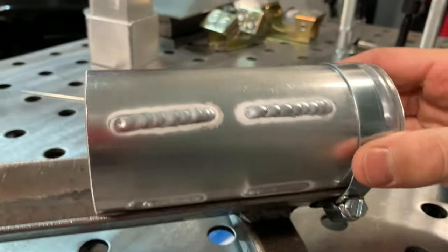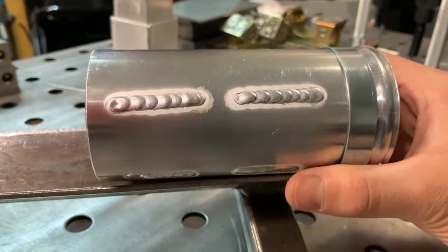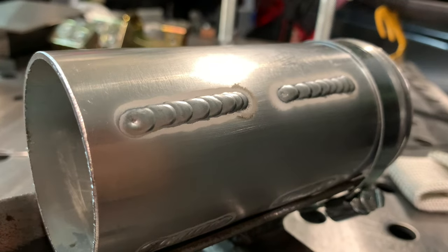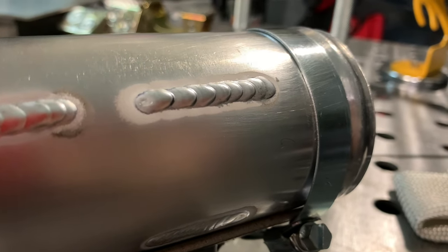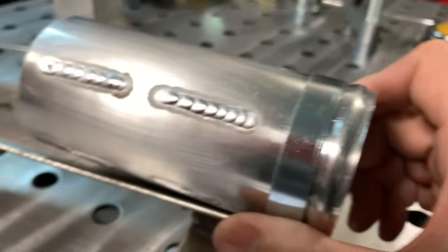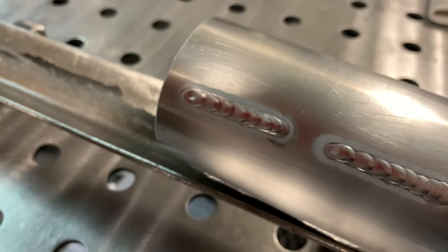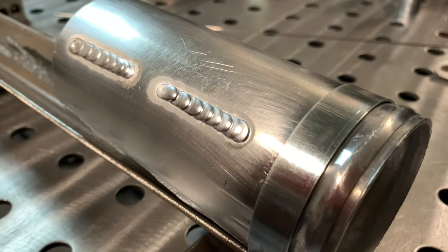Now this pipe's cooled down. Let's take a look at what 5356 does. This is some cheap aluminum pipe we got out of an intercooler kit. If you look at it — look real close here without getting any glare from the light — you can definitely see where it's a lot smoother of a bead without any of that graininess. And so for me, that is what my desired look would be. Going through the beads here, you can see how smooth and uniform they are. This is 5356 — super smooth, just really no graininess there. That's what I like to use.